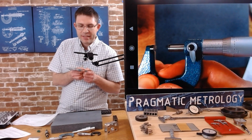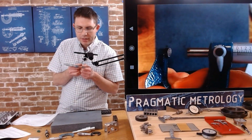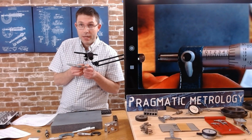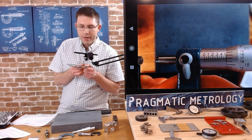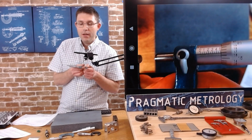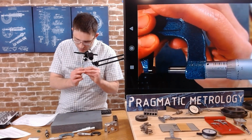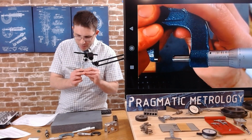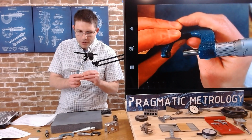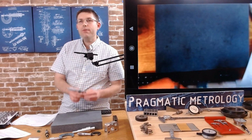All right, so I am pretty much almost dead on 5.17. I can't see any lines like I can between 3 and 4, between 4 and 5. There's those 3 lines. I cannot see them after the 5, so I haven't gotten any 25 thousandths yet. I've got 0. So I'm starting at 0.5, and then I'm going to add, because I'm falling between the 16 and the 17 on my intersect point, 16 thousandths, and I'm going to get the very last digit, which is probably 9/10 or 8/10. I would say 9/10 lines up the best from my point of view. It's a little bit hard to show that on the camera, but as I rotate this through, you'll see 9/10 lined up the best. So we're going to call that 0.5169.